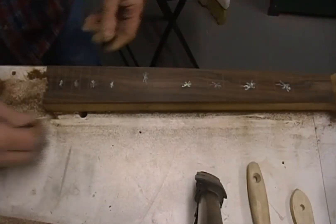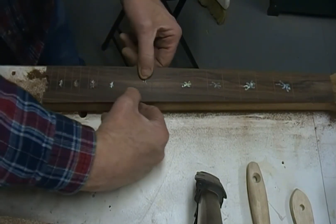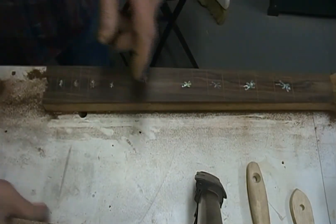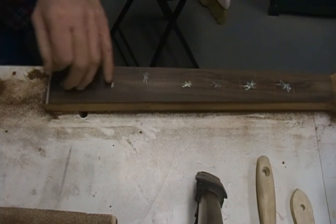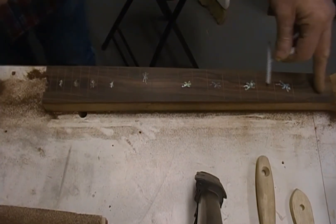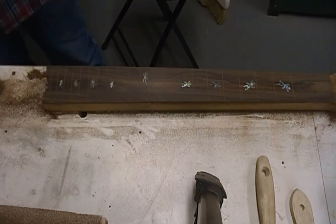You can see I'm pretty much exactly the same on both sides. It's flat right where the inlay is. It's radius all the way across the top and all the way up to the nut - that 16-inch radius. So I'm going to concentrate on this end and get the radius here, and then I've got a 9.5-inch block and I'll sand from the top end to accomplish that 9.5-inch radius.